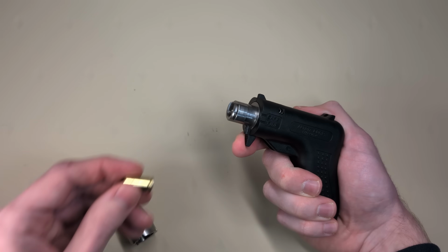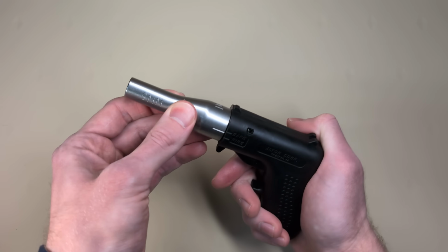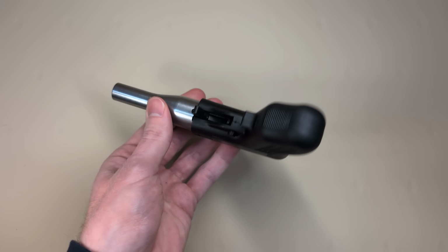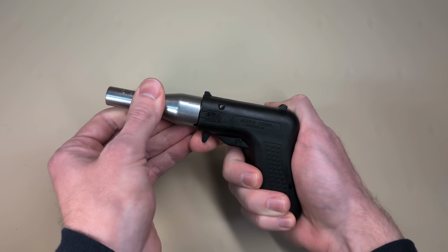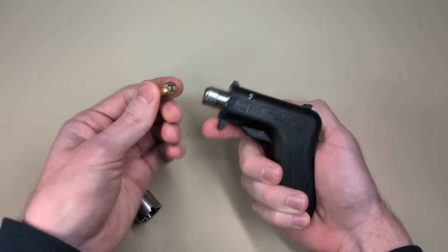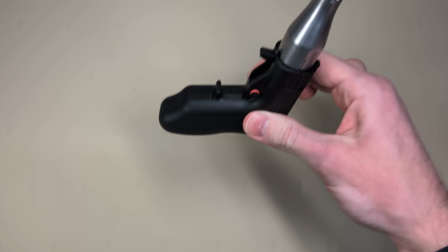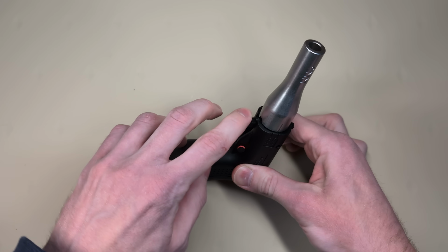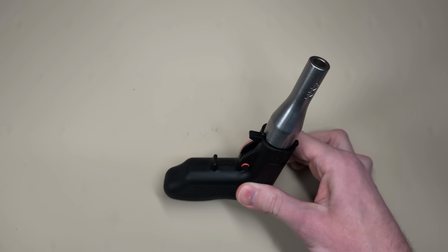Even if the barrel's still attached in the fire position, this gun is not bump safe. The trigger's exposed, and it's directly connected to the striker's resting on the primer, so anything that pushes it forward could fire the gun. Using just a primer and a gentle tap from this mallet, you can see we've made a dent. Uh-oh. There's also no drop safety mechanism, and while I doubt that a trigger with this little mass will have enough inertia to go back very far if the gun lands like this, there's no mechanical guarantee it can't.